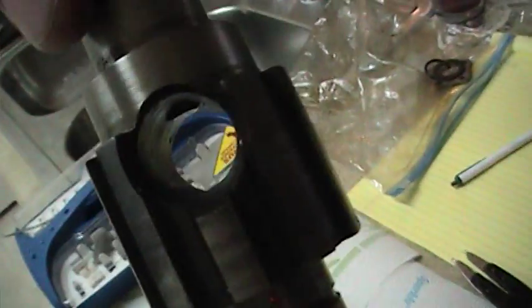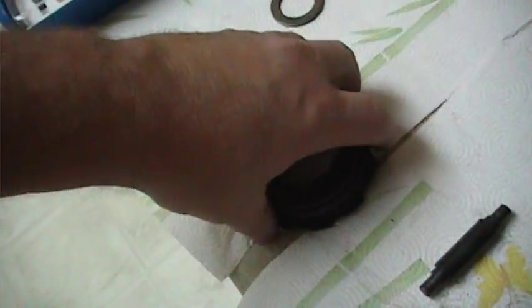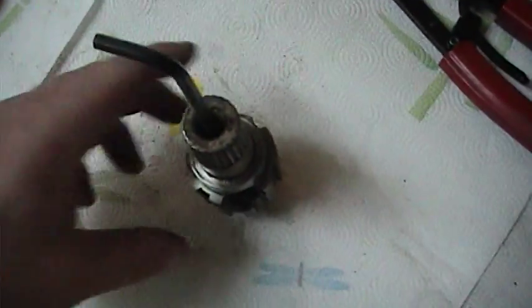Screw it a couple times and you can see it trying to edge its way through. That applies pressure to this, which is on the backside. These are Belleville Springs, and it sits together like this, applying pressure against those springs. That is where your slippage is reduced or not. By tightening this screw — it's a 3/16ths by the way — that determines the pressure that is on your clutch pack.